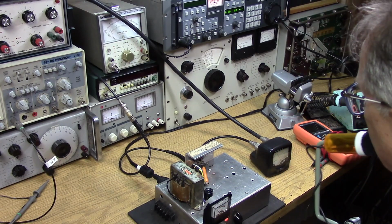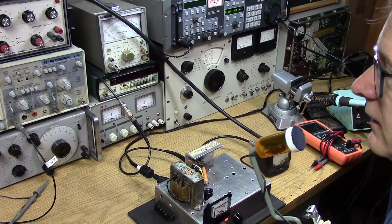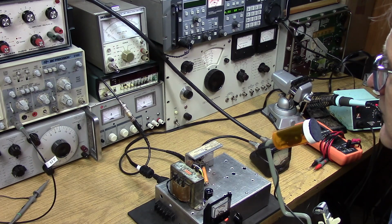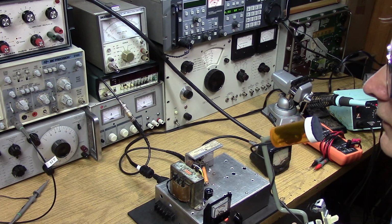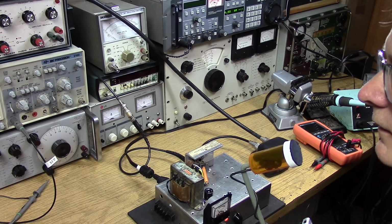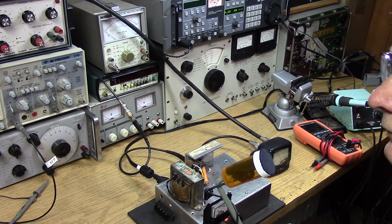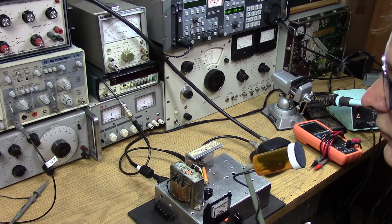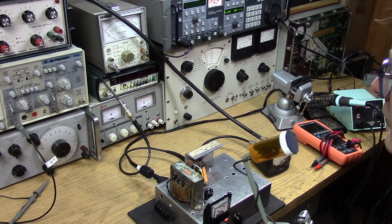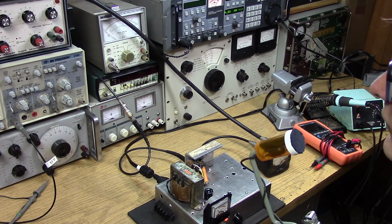Okay, very good, Steve, and thank you for letting me back in. I discovered that I had an 820 picofarad cap across the feedback on the little op amp that I'm using as the microphone amp, and that certainly was restricting the high end. So I've at least been able to lower that to 150 puff, and we'll see if this helps the audio. I'm going to have to do some fine studying on the audio and see what's happening, but maybe I've got a little more high end now, Steve.